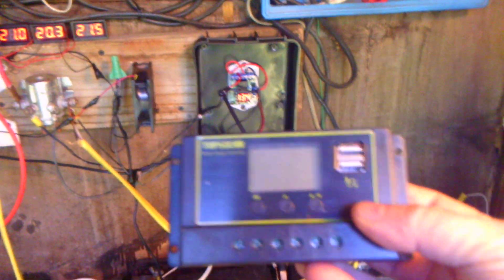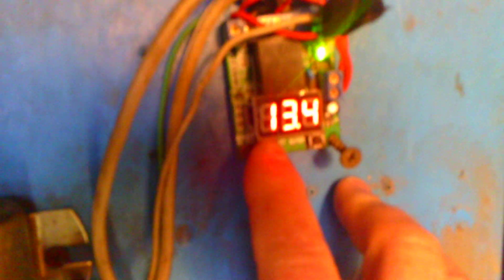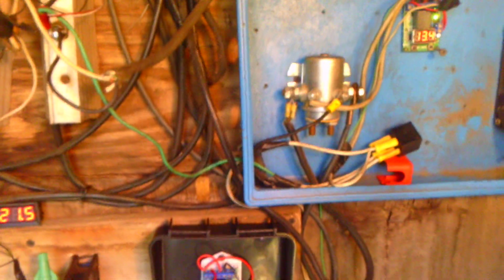They work if you're going to charge the battery on a lawnmower — that's about all they're good for. The computer is real simple — they make these and you can get them on eBay. I'll show you how it works: you push the button and you can set how much it's going to charge when your batteries get up. I've got it set at 14.5 volts — when they get there the solenoid shuts off. And this is your low end — you set it when you want your regulator to kick in and start charging the batteries. So when the batteries get to 12.5 volts my solenoid will kick in and start charging them. That's all you've got to do.